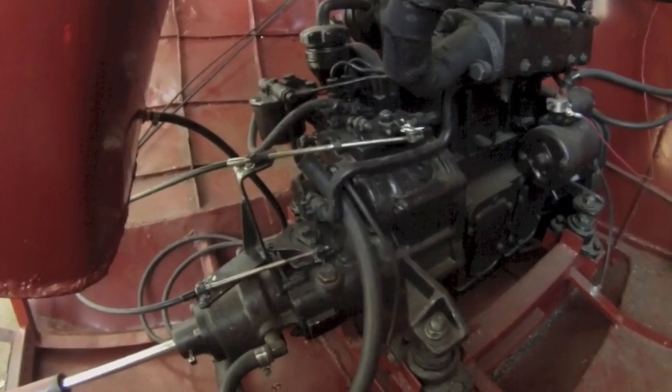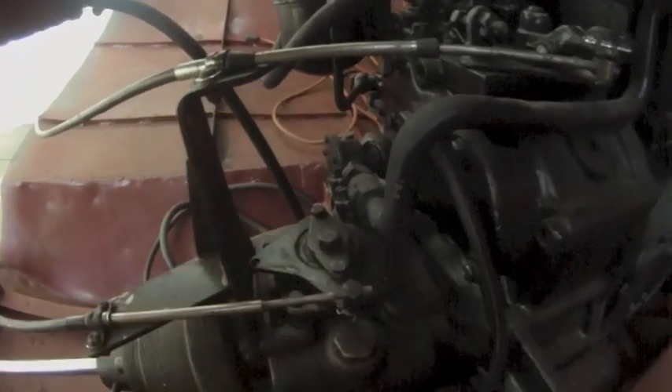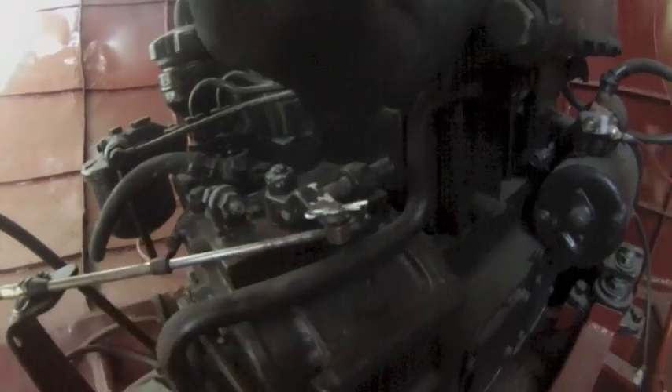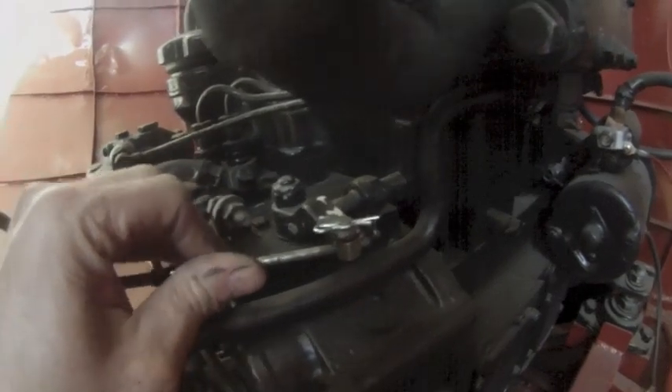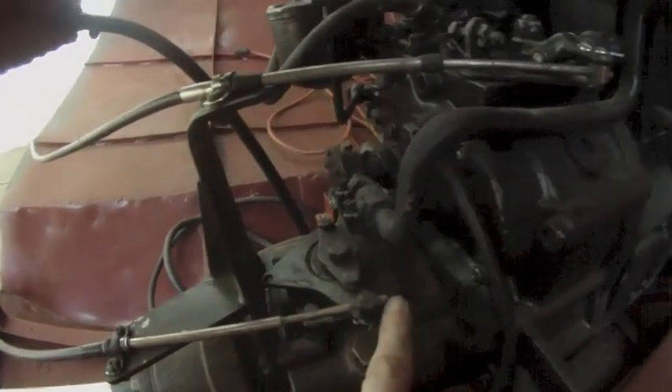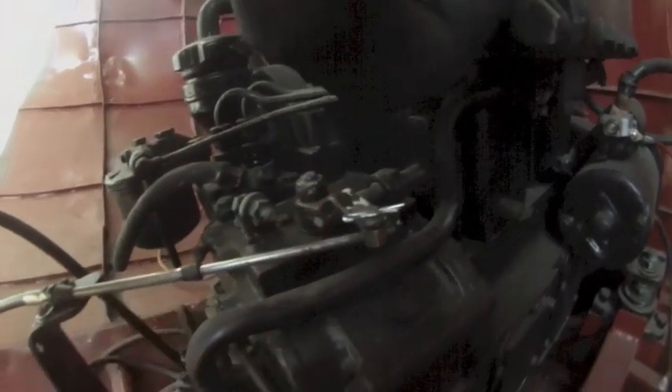This was by far the easiest job I've done so far on the boat. Right now this is the neutral position and here's neutral on the gears, and then when you go into reverse it will change the gears without altering the throttle for just a little bit, and then same thing with forward. Once you pass through neutral and push it forward it will go into forward gear without changing the throttle. The problem is it only pulls the throttle one way — it won't push it the other way unless I put the neutral setting somewhere I don't want to, because then when I pass from reverse to forward it will briefly go past the point where it wants to shut the engine down.